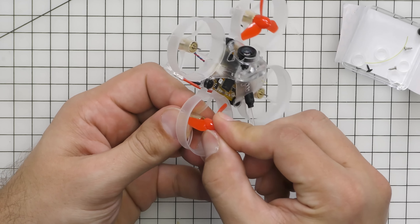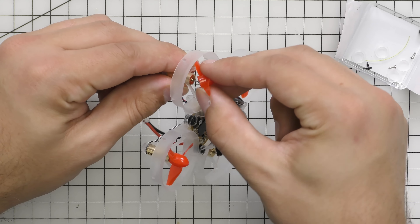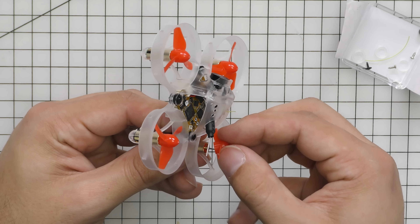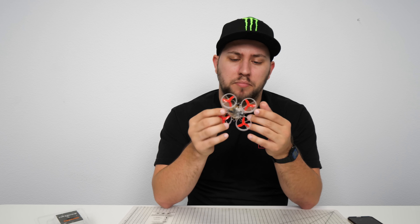Once those are done, if you're using the standard Betaflight motor configuration — which is how it ships — take the black and white wire, which is the counterclockwise direction, and put that motor in the top right duct. Fish the wires through so that the little pin at the bottom of the cockpit doesn't pinch them. Then plug the motor wire connector into the bottom of the FC. Do the same for the remaining three motors; red and blue will go on the front left and rear right respectively.